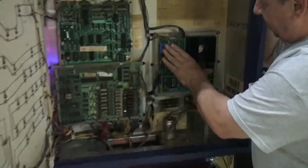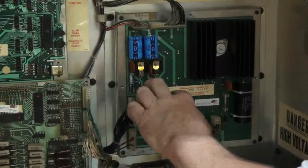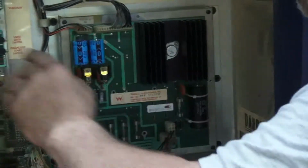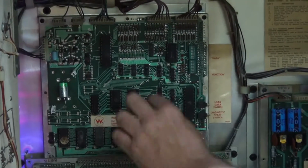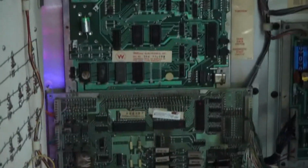We have new capacitors in the power supply. High voltage capacitors and resistors, so those displays get nice steady voltages. A new 5-volt capacitor for the logic board. We cleaned all the chips on these here, the Disco Fever EPROMs and Flipper ROMs, so the legs are making good contact. Lithium battery reflowed solder. We did the same here.